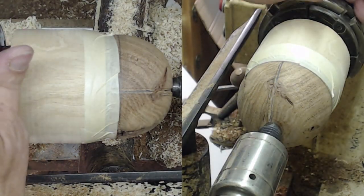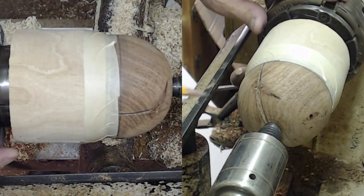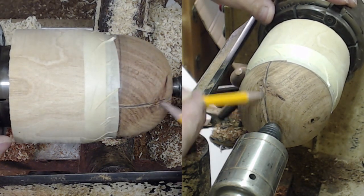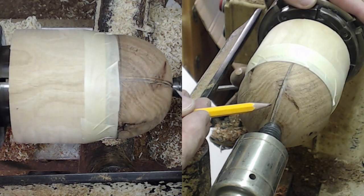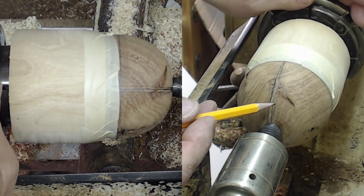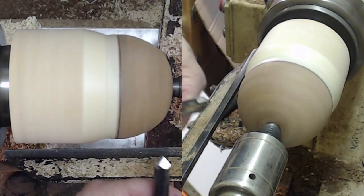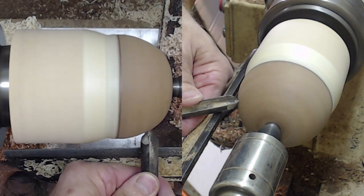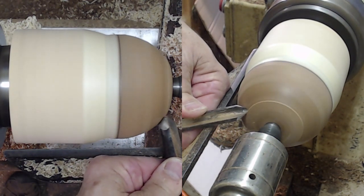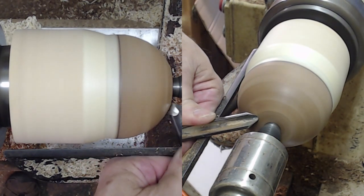What remains is to remove wood that is above the groove you cut. Depending on how close you came to rough turning a sphere, the groove may be quite deep. Any place where the groove is 1/8 of an inch or deeper, it is quicker to use a gouge to take off the excess. Bring up the tailstock to help hold the sphere in place and use your bowl or spindle gouge to remove some of the material. Take very thin cuts and don't remove material below the groove.